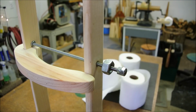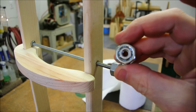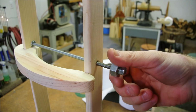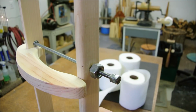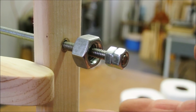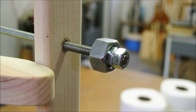I don't advise that you use a wing nut here. That's a nut knob. It's just a small nut pressed inside of a larger nut, and then, whoops, then it spins real nicely. I'm usually in a hurry, so I don't like to play around. And then just jam 2 nuts together for this outside part. The nut knob can then spin out of the way and around those jam nuts.